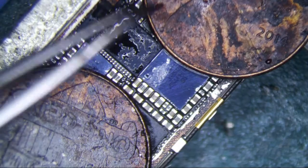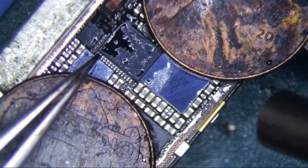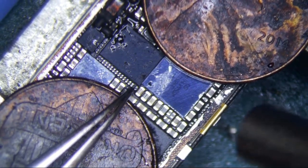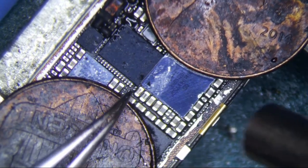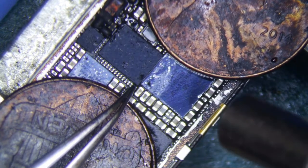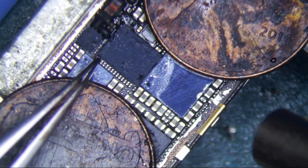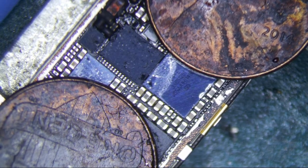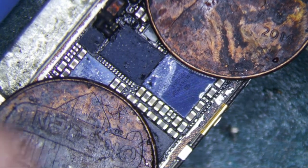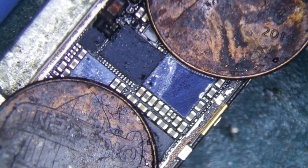You want to cover these two components up here because those are the WiFi components — you don't want to direct the heat that way, otherwise your WiFi may get grayed out and make you go into a little bit of a mini panic. So nudge it a little bit — nudge the top a little bit. The idea is to break the surface tension of the solder and hopefully get a nice little adhesion, with the flux sandwiched in between. You want a nice little joint underneath the BGA chip.